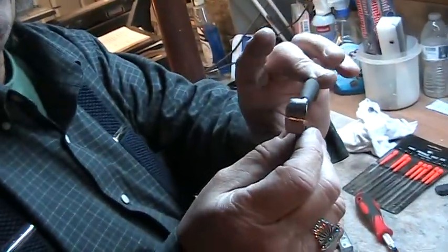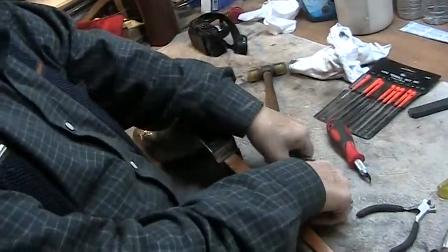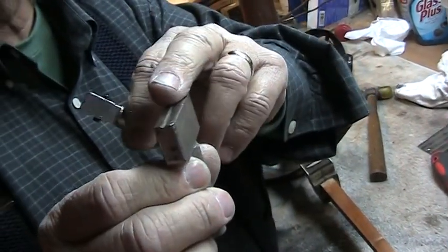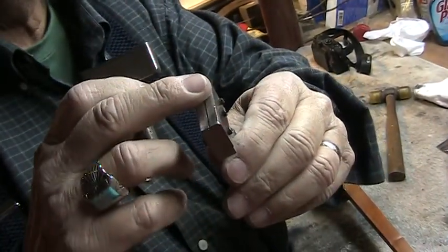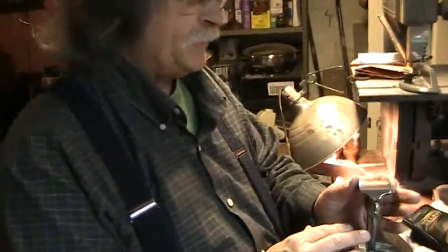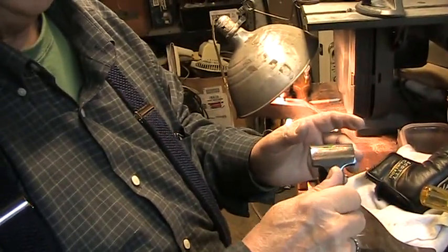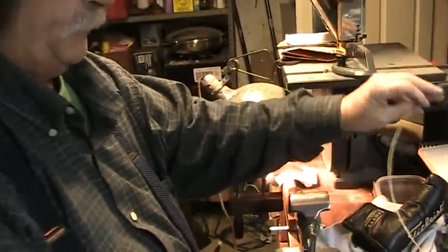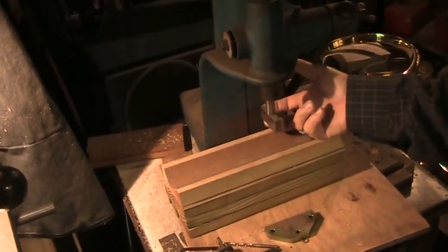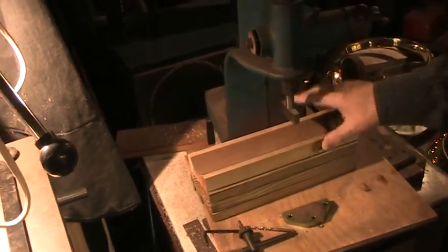We need a couple of pairs of nippers, sometimes of this type. I've got two different tools here. You can see that I've got a groove set in, and that's for the fret, and this one is a little different setup — this is for getting the fret started into the fingerboard. To prepare the fret I have this little machinist hand vise, and of course you'll need some fret wire. Over here I have an arbor press with that tool in it, with the groove on the bottom for the face side of the fret, for when I press them into the neck.